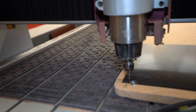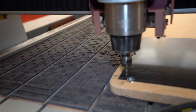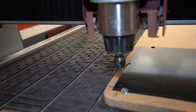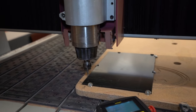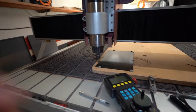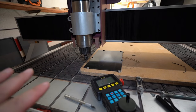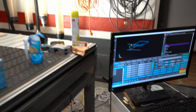So of course I will elevate the Z only. We go up somewhere here. What happened now? All of my other coordinates are correct, only the Z is not correct, and this will be my new zero. So we will cut the air. We will not cut anything else. So now this is my new zero, and let me cut the air.